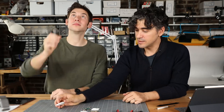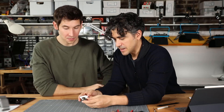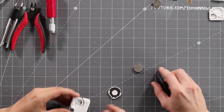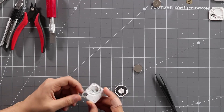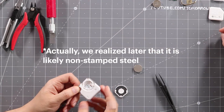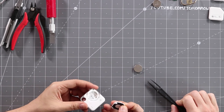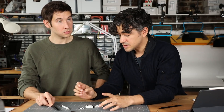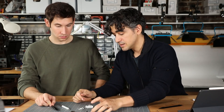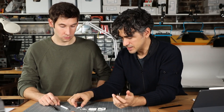Part two: we're going to take apart the new Tile. Same battery — they even went with the same maker. It's a CR2032. This looks like it's almost identical in terms of assembly. They have a ring, but in this case it's a stamped piece of aluminum instead of this much fancier bent piece of metal. It looks like they've welded around it. Once again, they're doing their water resistance by putting foam around their ports. They're significantly less conservative with the real estate — I can think of a dozen ways to make this tighter.